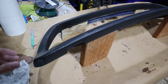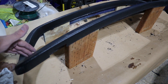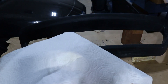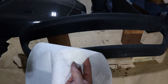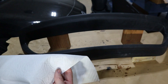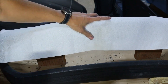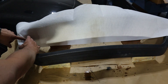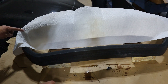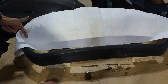I'm not thinking I can do this all in one piece because it's got a drape, and especially right here in this corner it'll kind of bunch up. What I've got is some paper towel — you could do this with pretty much any fabric. This is just so you don't get in a situation where you've got the epoxy all mixed, your pattern cut out, and then it just doesn't lay right. For this main section, it will conform just fine until you get about here, then it gets really wrinkled. I think I want my seam on the inside because this side is going to be more visible, so I'll have the seam in here.